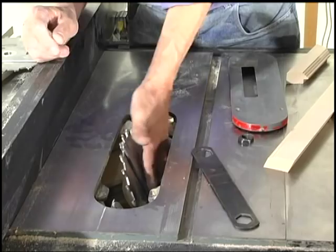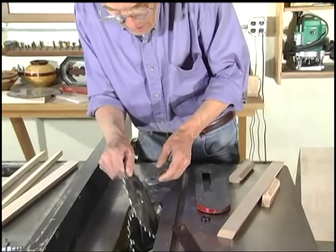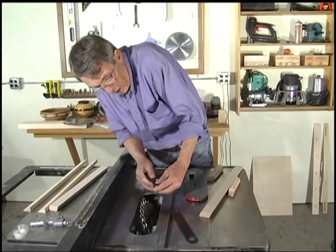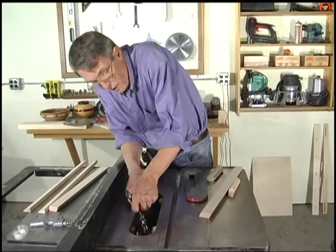And what's going to happen is, since we're cutting the top of the dado, in other words, the rabbet, the surface the picture sets against, is cut with the top of the blade at exactly the same angle that the edges of the material were cut along the side of the blade, that means that this molding is going to be absolutely foolproof. In other words, we don't need to worry. We could have eyeballed the blade tilt, and this technique works.